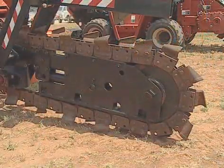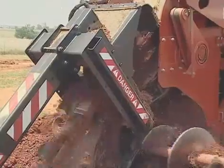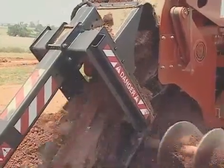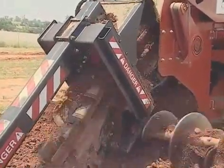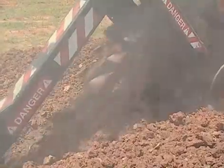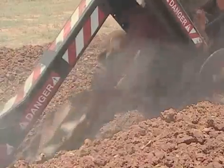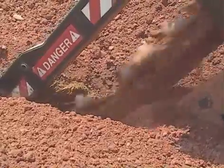There are three cardinal rules for digging systems to keep in mind. First, always replace sprockets at the same time you replace a digging chain — sprockets and chain are designed to work together, and replacing one without the other will cause premature wear of the new part. Second, keep digging teeth sharp. Using dull, worn teeth will decrease production and increase shock load to other trencher components. It can also cause chain stretch, leading to premature chain wear and failure.